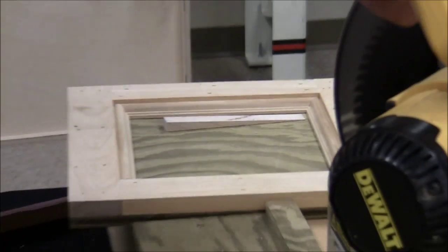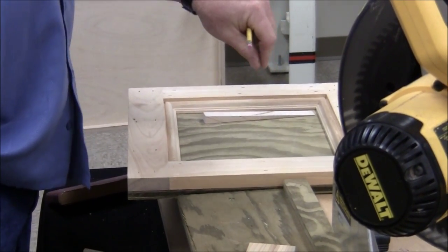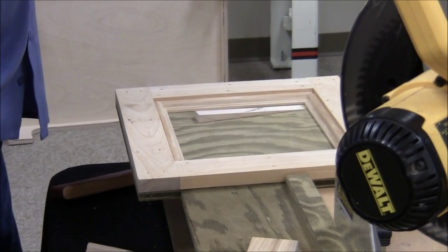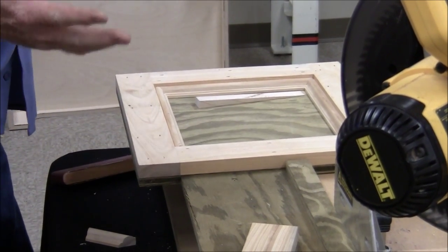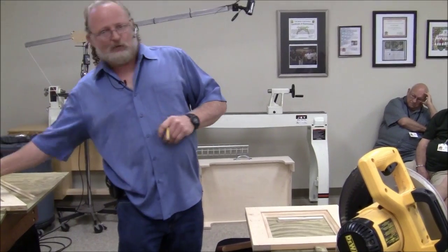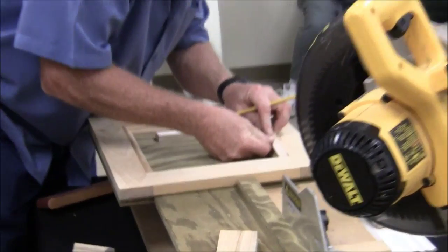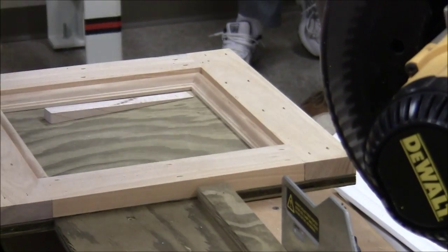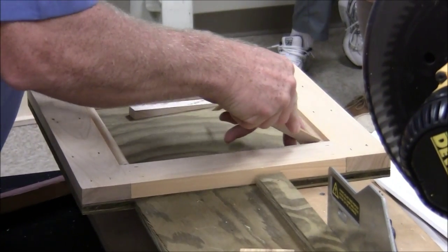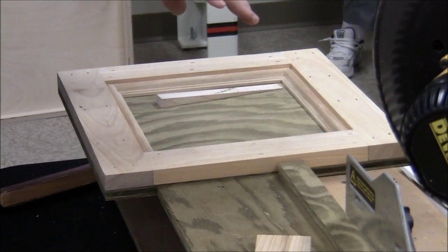Every now and then they don't come out so good and you've got to cheat. The easy way to cheat is to put glue on these, and when I put it down in there I'll take a piece of sandpaper. A lot of guys put molding together and the profiles don't always exactly line up — sometimes they're a little ridge. I'll take a wedge, wrap some self-sticky sandpaper around it, and just knock off those high points. If I've got a little glue, as long as I keep pushing it back into the joint, the sawdust will fill any little crack.